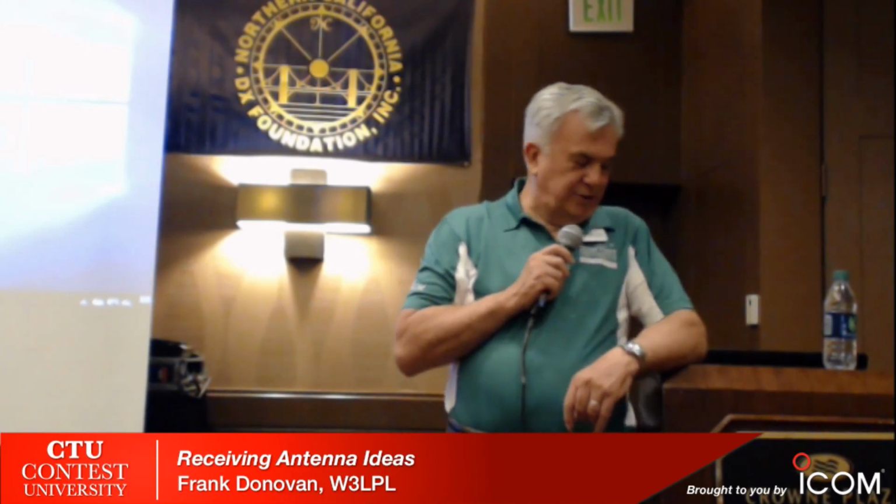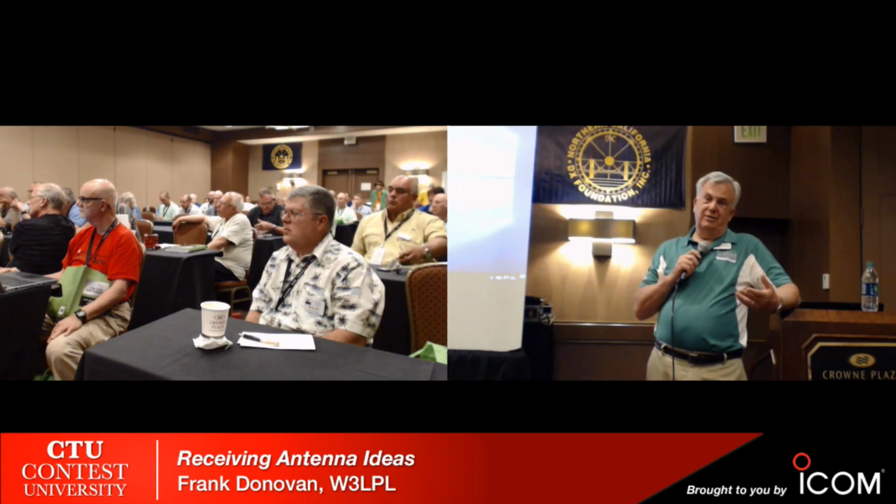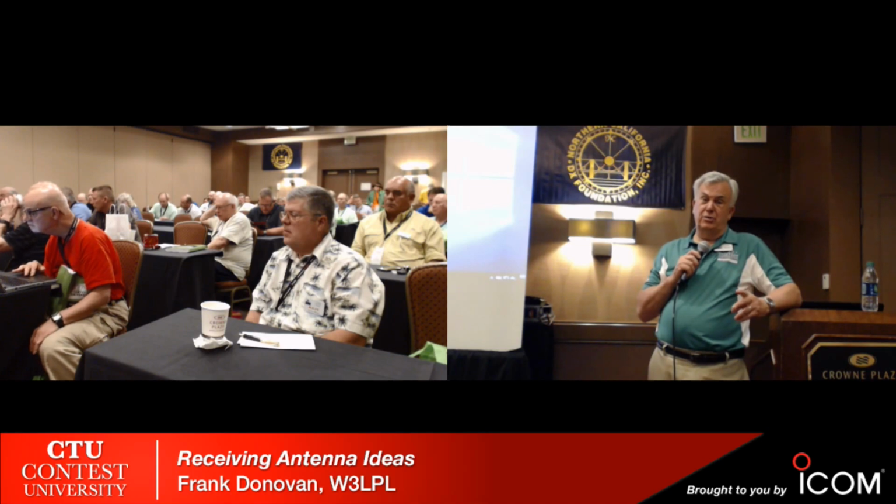Boy, those are really good questions, and unfortunately, they don't relate very closely to my own personal experience. But in the urban environment, where you have lots of local noises from very many directions, in many cases a horizontally polarized antenna discriminates against that noise pretty well. On the low bands, a low horizontally polarized antenna is very inefficient, but signals are very strong on receive. So I think a low horizontal antenna is worth trying. But how well it performs depends a lot on the details of the noise sources, what polarization they are, how close they are, and all kinds of other things like that. And I've never personally used these.